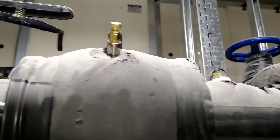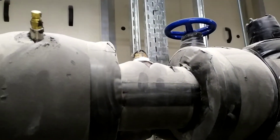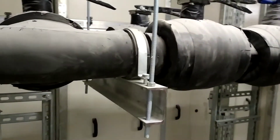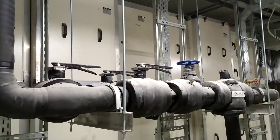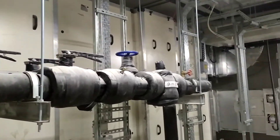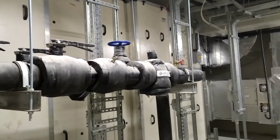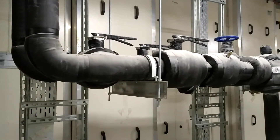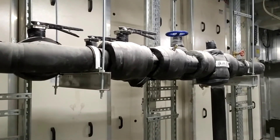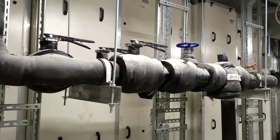After that, here is a test point which we use for temperature — like a thermostat — and again a butterfly valve. This is a complete valve package that you can look at and understand by watching this complete video. This is the valve package of a FAHU or AHU. This kind of valve package is mostly used for FAHU and AHU. Apart from this, the FCU valve package is different — I will show you the FCU valve package in my next video, and I will also show you in detail about the PICV.